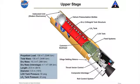It has thrust vector control with the engine for pitch and yaw, and then we have a roll control system. That roll control system also controls the roll during first stage flight, because we can gimbal the solid but that gives you pitch and yaw — not roll. So that's the responsibility for that.